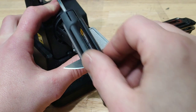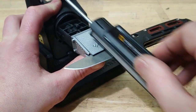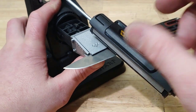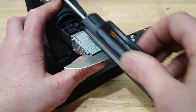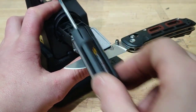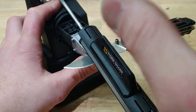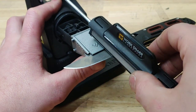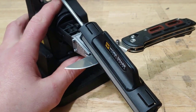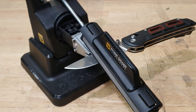I've spent quite a bit of time on this edge and you can see how blotchy it is — it's not finished, so don't critique it as a final result, but you can see the blotchiness. That is because of the little bit of movement. What I have to do is make sure I put no pressure — hold it with my thumb underneath and go very lightly — doing that with both stones starting with the 300 grit, then the 600 grit with the same light pressure. But no matter what, you still get that rocking. I'm talking about the up-and-down movement — that little bit is what will cause that blotchiness. You just have to be as careful as possible.